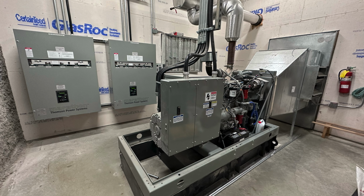So we could put on the 60 or whatever we could get it up to, and then we could flip the one transfer switch that was still tied on, because we had to disconnect the one transfer switch to tie in the load bank, and then the other side was still connected to the transfer switch, so we could manually flip that transfer switch and put the building load on it to help us load the generator a little bit more. Anyways, that's just sort of what happens, is every situation depending on generator size is a little different.